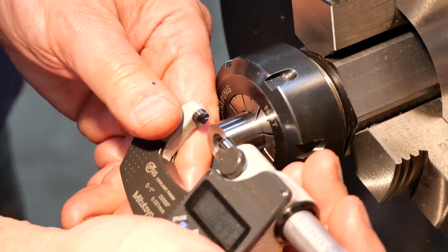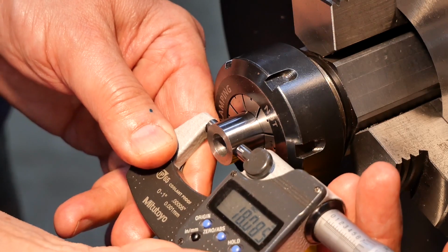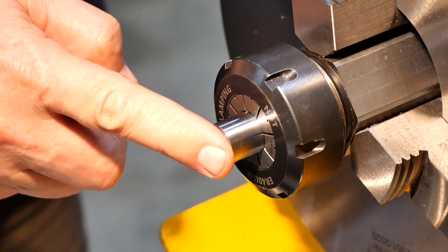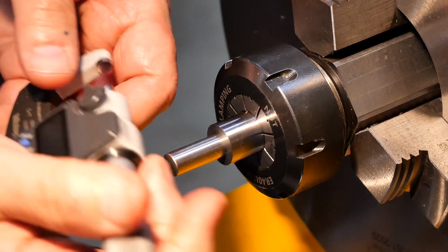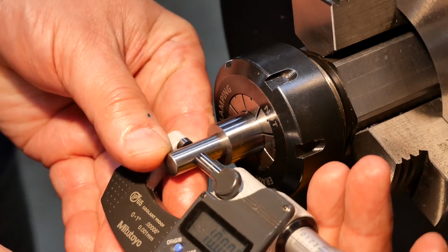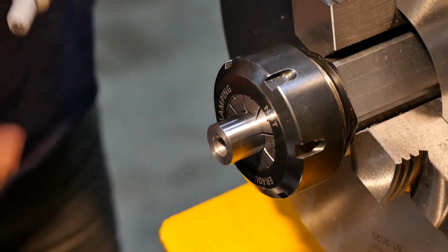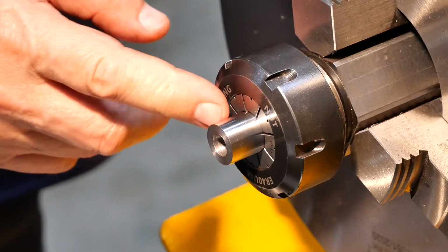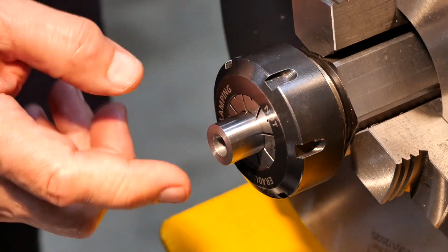to be 18.08, and I think we've pretty much got that there. I think you can perhaps see. And the drawing also, I've a bit of a hybrid between metric and imperial, but I'm going for a 10mm here. So that's a pretty good fit in there, my 10mm dowel. So that's all good. I don't know how many times it's going to take me to get this, but I've turned up 50mm of stock at 18.08 dimension, although I've only actually bored it to 20mm deep or something.